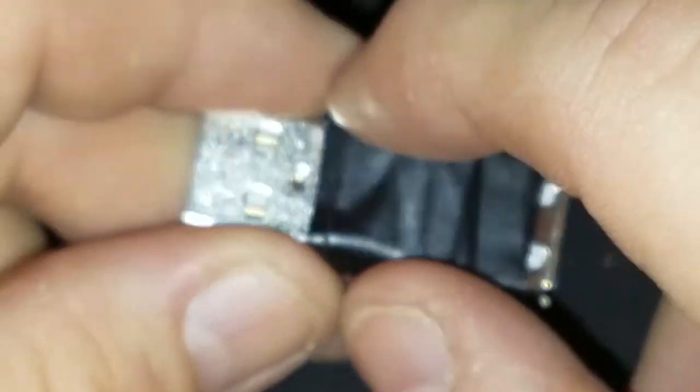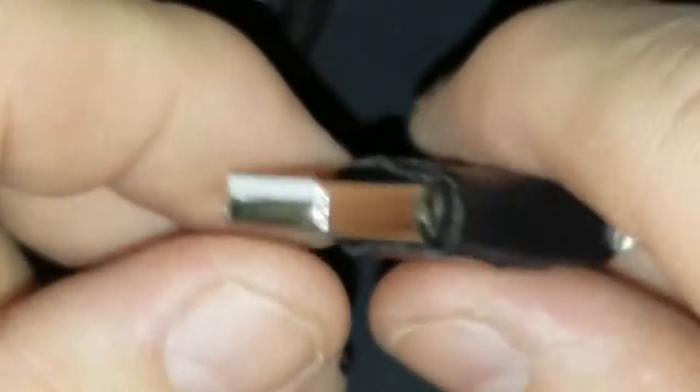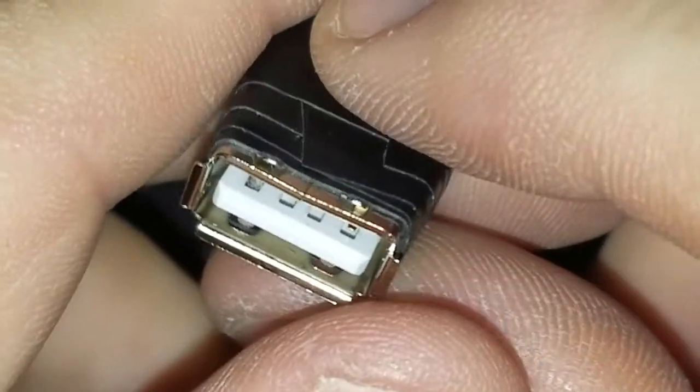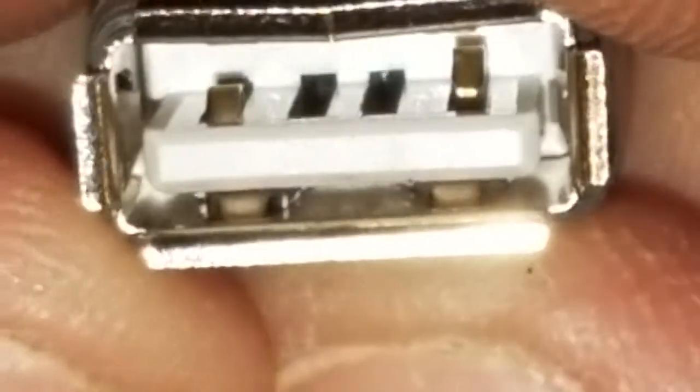These are for Android devices. Now, if you have an iPhone, you've got to put a resistor in there. I don't know the exact specs, but you've got to run it to the D-positive and D-negative lines — you need like 2.7 volts on those lines. But this will let power flow right now. It's not connected on the center leads; I pulled the two center leads out in the middle on that side. This side is shorted — this side will go into the host, and then you plug your cord into this side here. You can use any cord now, so I don't have to have USB-C or USB-A or any of that. Just a regular USB goes in here.